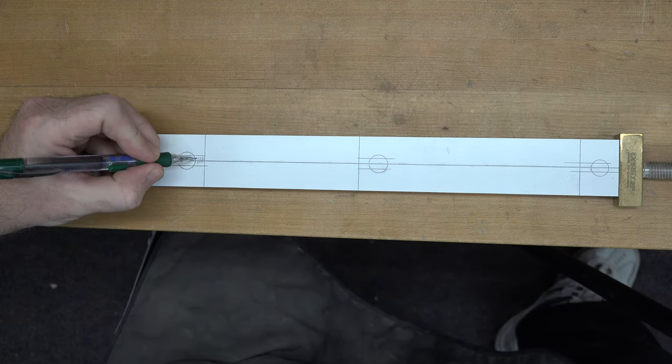You may be wondering why I didn't just overlap the pieces, put the male one inside here and trace around it. The problem is there's a sixteenth-of-an-inch difference between the two, and a scroll saw blade is thinner than that, so the kerf would not clean it out properly. I'm better off cutting that small loss — it's only about three-sixteenths of an inch. I'll carry on marking these out.